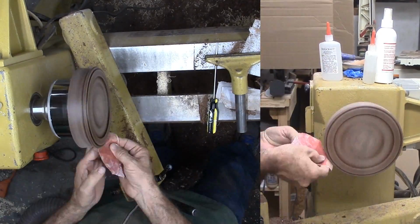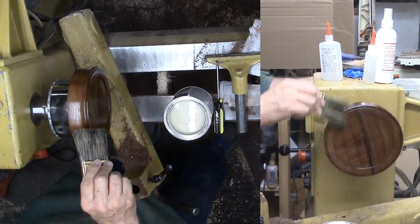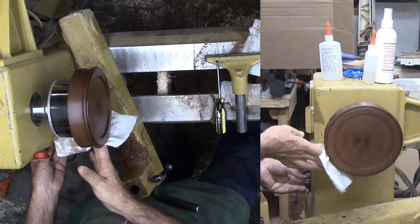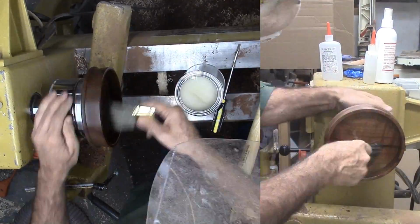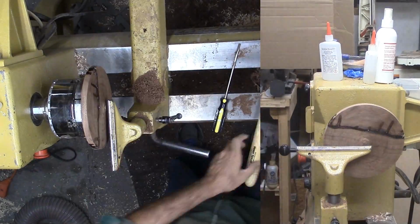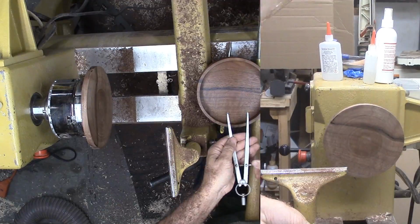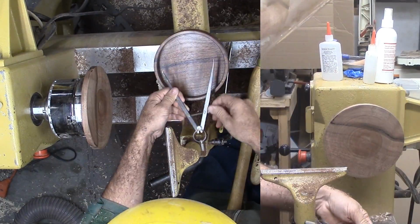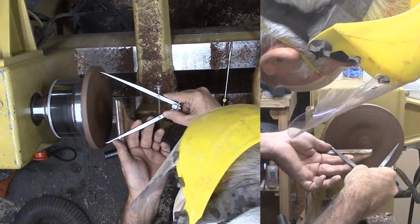Then back on the lathe for another coat of lacquer after sanding it just a little more with fine sandpaper. Now I can flip it around again to finish the bottom interior. Next, the lid, starting with the tenon I cut at the very beginning. After a little flattening, I need to fit the lid to the box with a shallow, somewhat loose tenon.